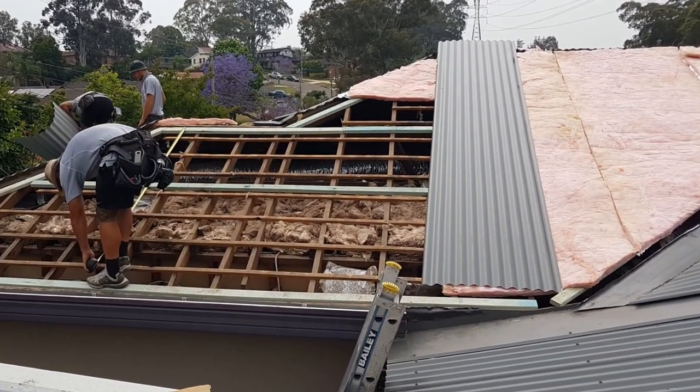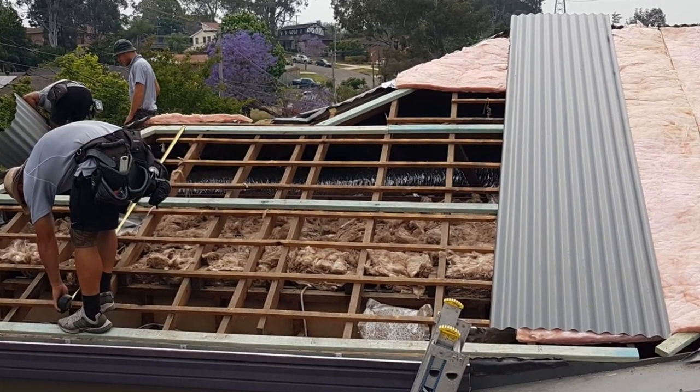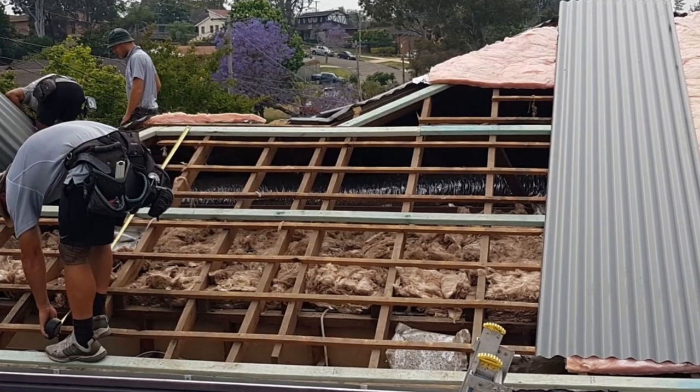With the metal roof, it's insulated and you don't get a lot of heat going in. The other thing about a metal roof is that when the sun shines on it, it gets hot, but as soon as the clouds come over, the heat just dissipates and it doesn't hold the heat. Whereas tiles hold the heat for a long time and the ceiling cavity can stay really warm for a lot longer than with a metal roof.